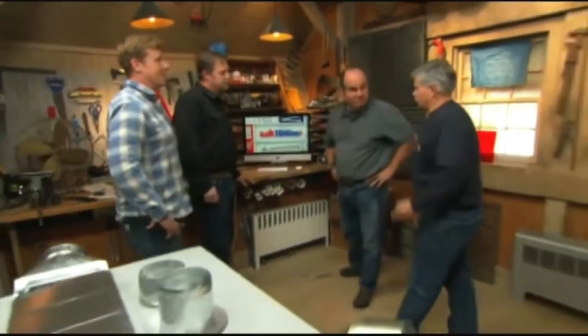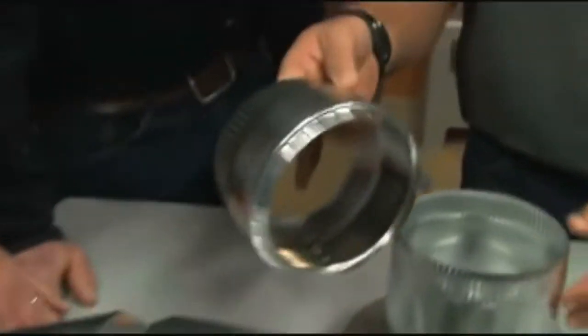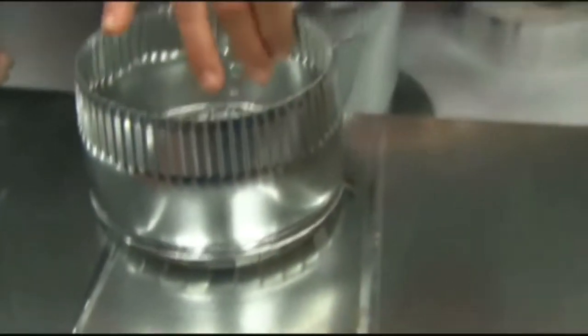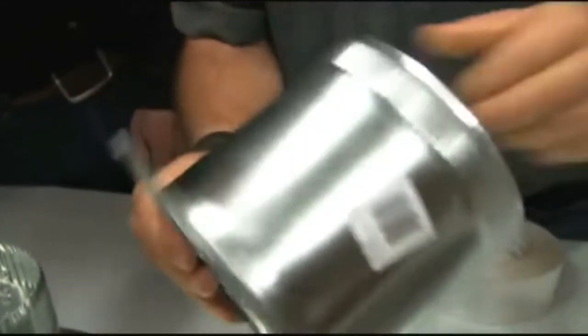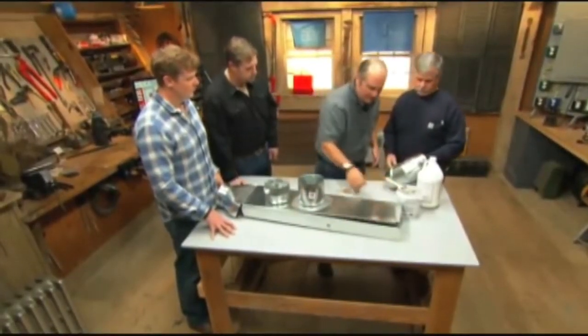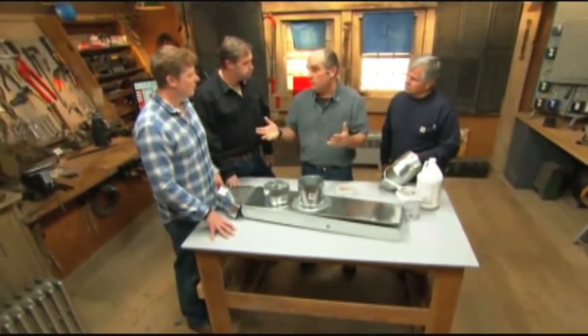I think your whole system is going to work better. It's going to be more comfortable, more energy efficient, and it's going to be cleaner in the ductwork. I like the way that tightens up the system. With metal ductwork like this, every time we have a longitudinal seam right here, this is not airtight — it's going to leak out through here. Every time we bring two pieces together, it wants to leak. These are both called takeoffs, where we come off of a branch right here. These have metal tabs — you cut a hole, bend the tabs — well, that's not going to be airtight. And look at this one: it has double stick tape on the backside, so it'll make a nice tight seal. What about all these swiveled elbows? The swivels are never airtight, so you're going to have to use a mastic or the foil tape right here. The issue is we're losing 20, 30, 40 percent of the air that should be going into the living space for heating and cooling going to the wrong place.